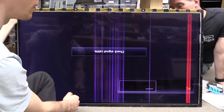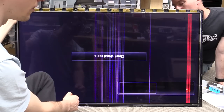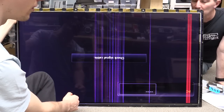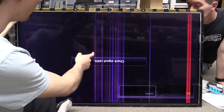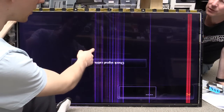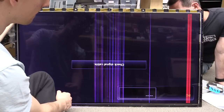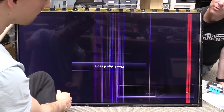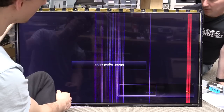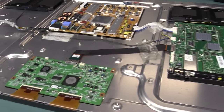Well, that's the main ASIC on the processor board. Although shortly before that I was spraying some of the memory — the ASIC memory that's surrounding it. Yeah, it only takes one bit to get every second row missing. So I don't know — is our money now on the processor board? You were definitely tapping the processor board, right? I was, yeah.